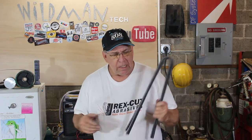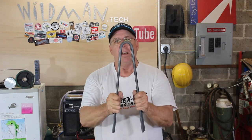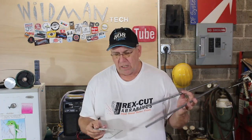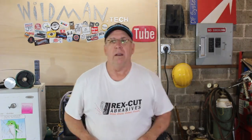On to the actual hairpin legs. There are only a few factors involved in being able to reliably reproduce anything. One is your stock — every piece has to be the same. Every one of these is within a sixteenth of an inch of each other; there are four of them here. So the only thing left is to make sure the rod is in the same place and the mark is in the same place every single time. The way you do that is by building a fixture, and that's what I'm going to do right now.